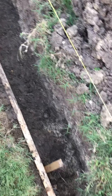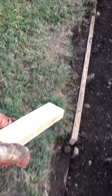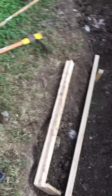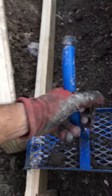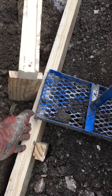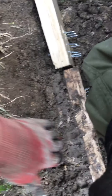Nothing is screwed in, they're just kind of tapped there. The idea is to get this little form right here going so when I pull it up that'll be my base for leveling out my cement. I still need to put my rebar in, but this thing is about as wide as I need. This is the outer form, and as I make my table here with this mud, the mud will actually be the outer wall.